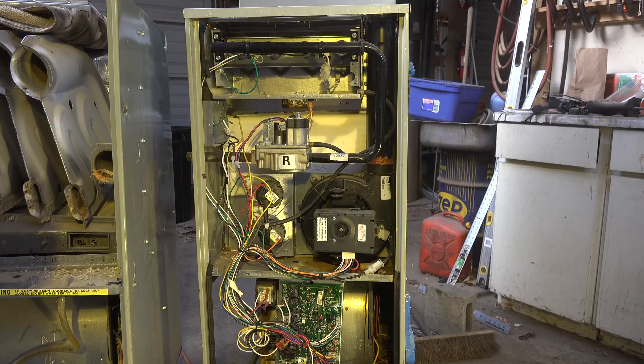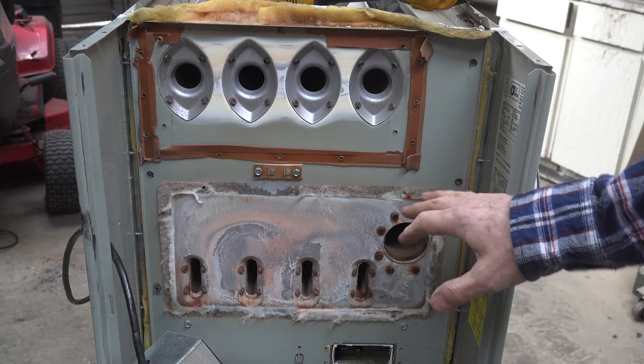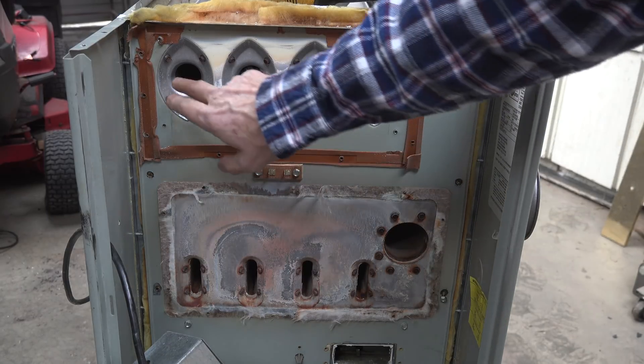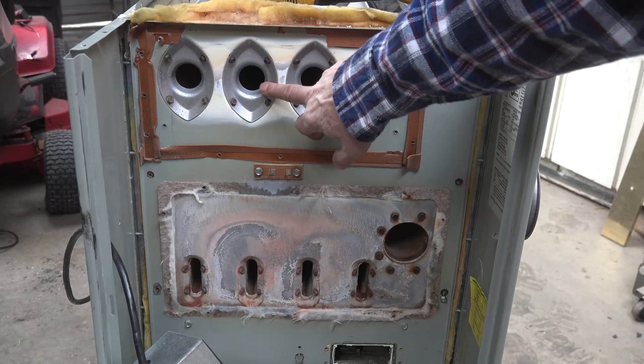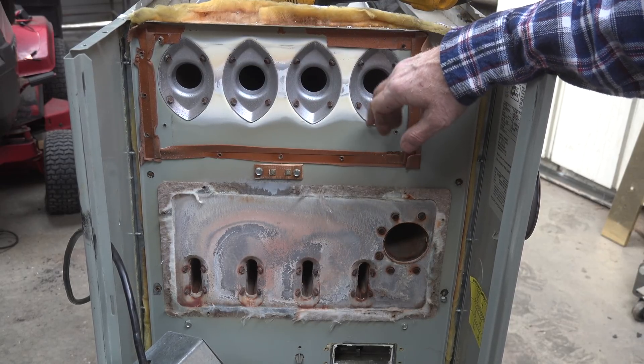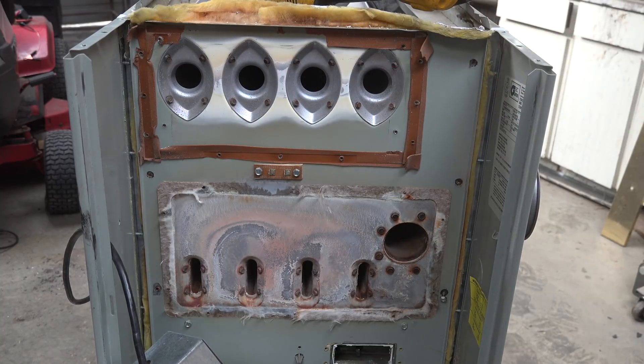I'm going to show you what this looks like when you start tearing it apart. You're really going to tear this furnace down into little bitty pieces. Here you can see I pulled the burners off. We're actually going to be able to preserve most of the flame safety controls on this thing. The burners shoot right into here and I want these orifices. They're hooked up to the heat exchanger, so I have to remove these, but then I'm going to mount those back up again on this plate, and I'll show you what I do there.